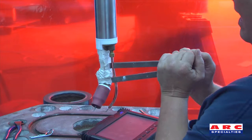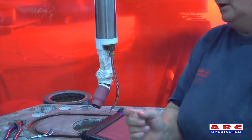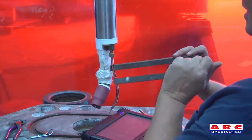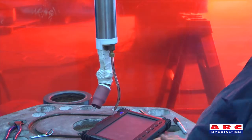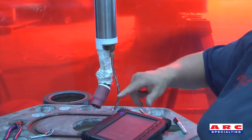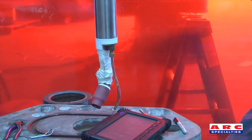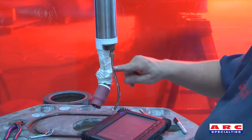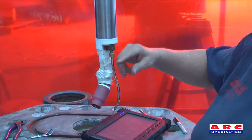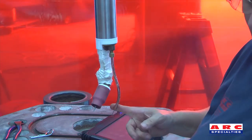Then move down. It's important to keep bending it until you get past the cup. Once past the cup, try not to have a lot of bend in one spot — make a smooth transition out. Either start bending here or start at the top. However, if you start at the top, it will be necessary to cut some of the wire guide off because it will be too long.